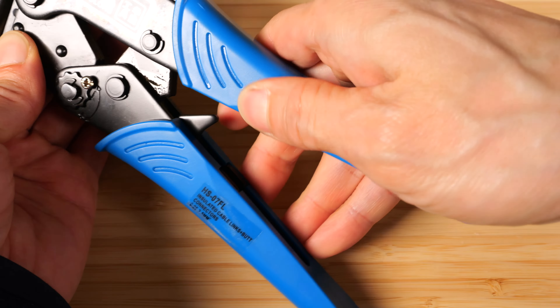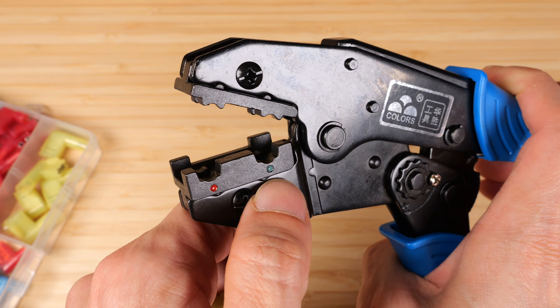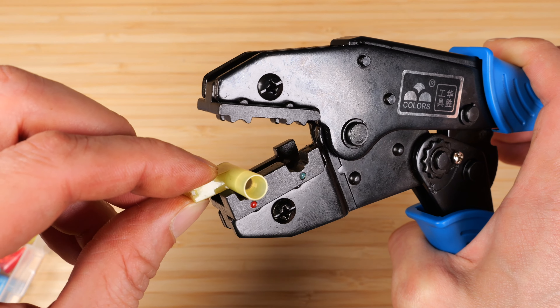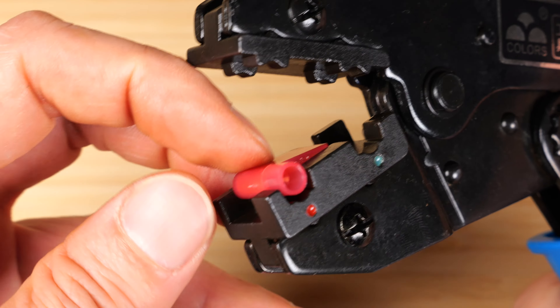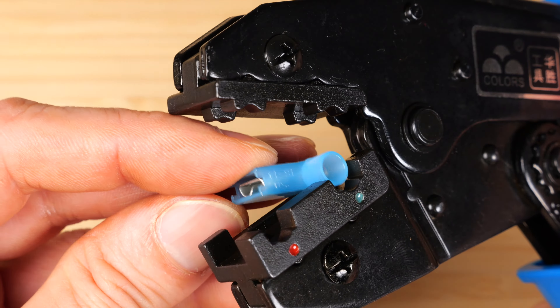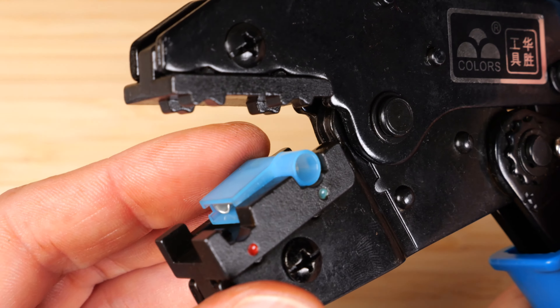The grip is more plasticky — not too rubberized. When I bought this, I saw there's a red dot and a blue dot, but no yellow dot, because the yellow terminal doesn't actually fit in one of the jaws — it's a little too big. For the red position, you just put it in with the flag heading towards the inside and crimp it. For the blue one, you face it the other way, put in your wire, and crimp that.